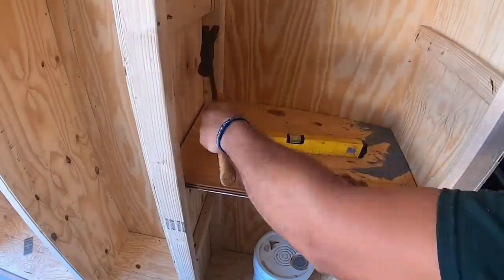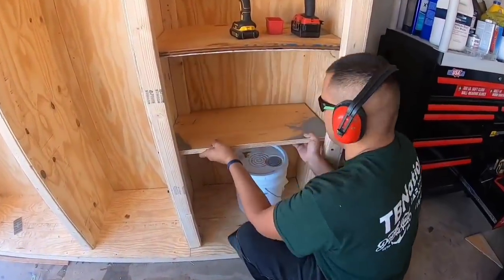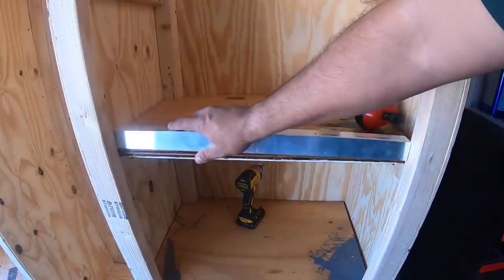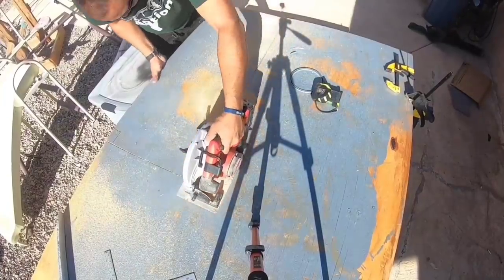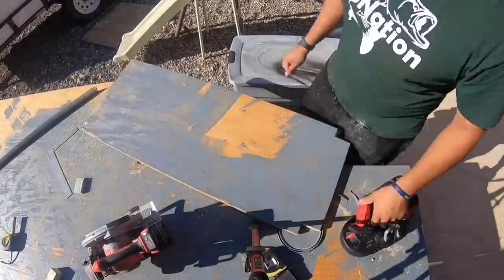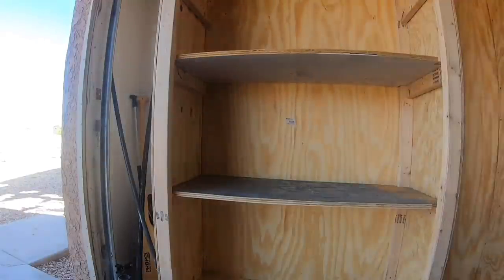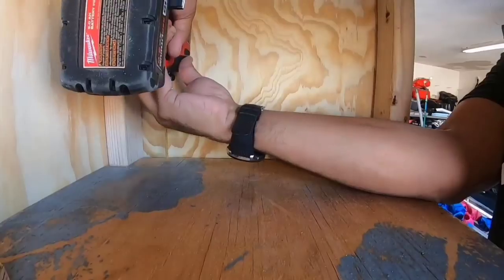I had scrapped 3/4 plywood in the back of my yard that I was saving for a project like this — that's why you see all the residual paint on it. The 3/4 plywood is very sturdy and doesn't need any additional under-supports; it's very strong by itself, especially for a span like this. Before face framing, we're going to cut off all the shelves and eventually preserve this entire unit with oil-based enamel to saturate all the pores in the wood and make sure no liquid, solvents, or chemicals can seep in and degrade it, cause smell over time, or rot.